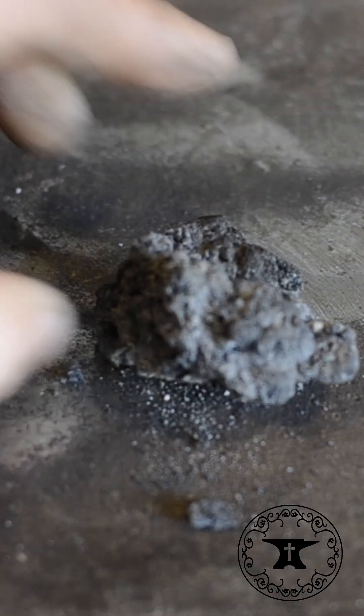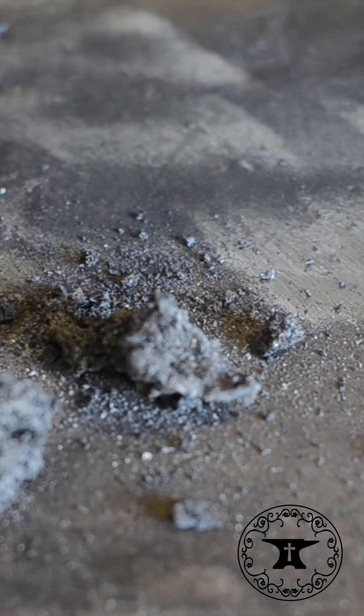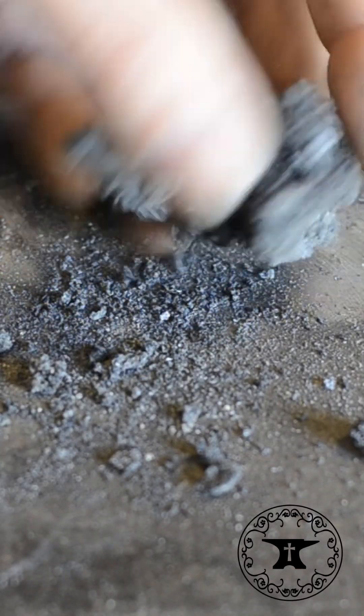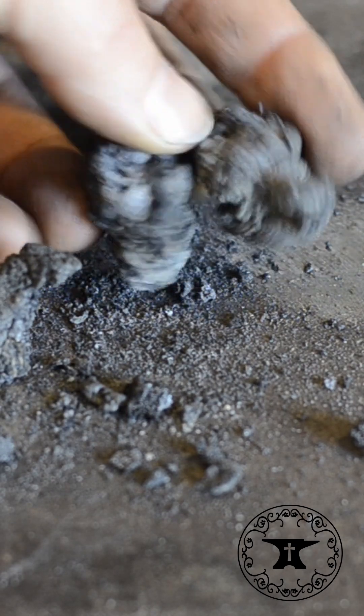From breeze, it goes to coke. It's also lightweight, but it's not as easy to break up — it's a lot harder. This is what you actually forge in. Coke is what gets you those hot forging temperatures, those forge welding temperatures, and that whole bit.